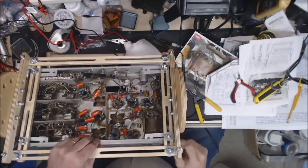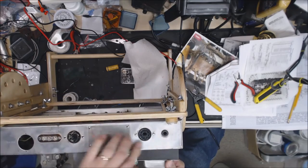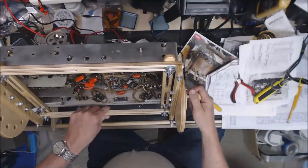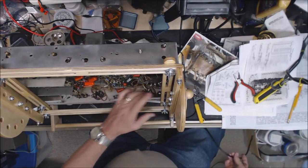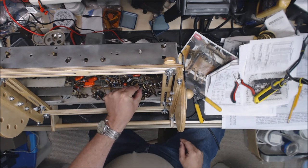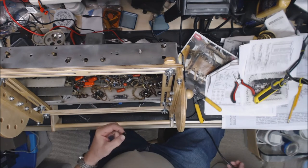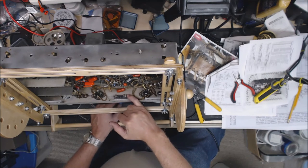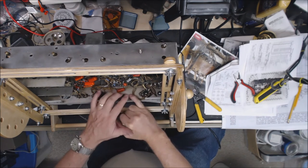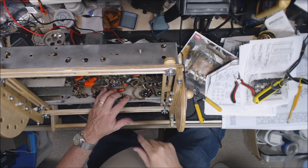I put a grommet in the hole that the old cord used to go through. So, regular rubber grommet. Then feed the cord through that grommet, and I use this nut and bolt off the transformer to hold it in place. Tie the hot end here, and then run from the hot end over to here. And then we'll run the neutral or the common end to there.